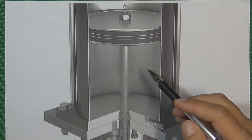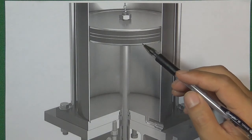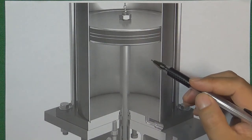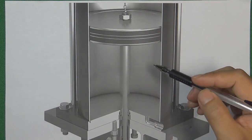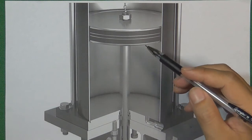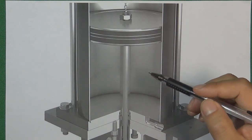This kind of pneumatic control valve actuator uses pressure air to control the piston, and we can control the piston to move in two directions — one is move up and another is move down. So we call this kind of pneumatic control valve actuator a double-acting actuator.